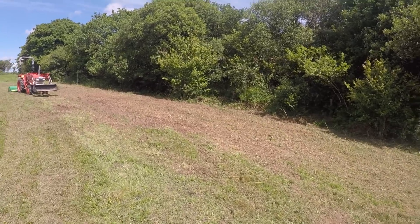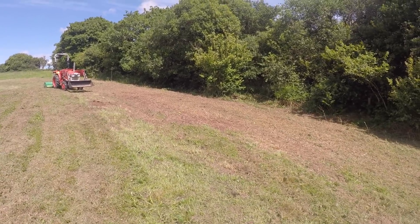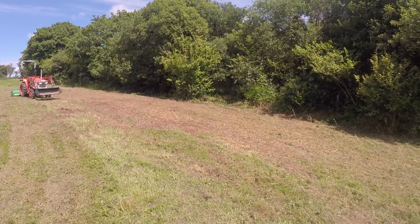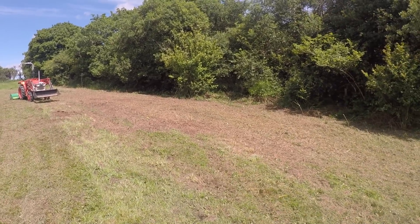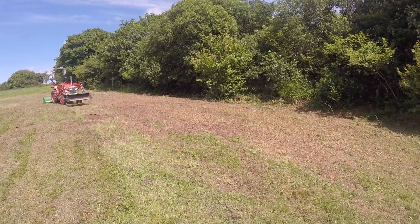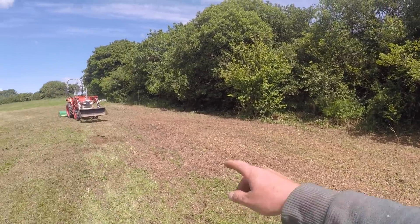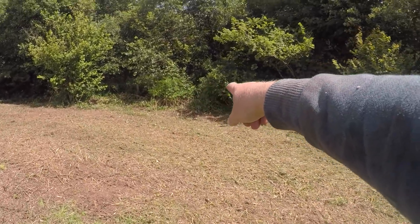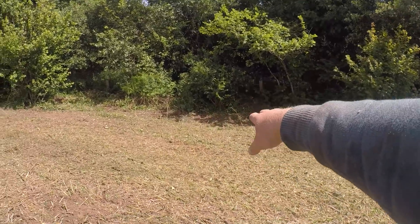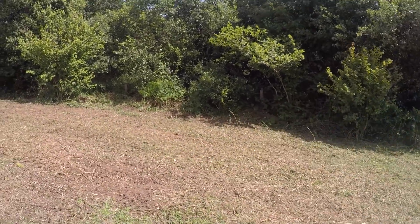That's the area cleared. That was essential because if I'm going to put the building here, there were trees blocking it — and obviously it's a solar shower, so the sun comes from in front of the building behind me, so it was essential I cleared that out. The boundaries are there; that area's not supposed to be woodland. Now I can see where the building goes. I've taken measurements and I know I can gravity feed the water. It looks most level just there, so that's where the toilet's going to go. Next step is to start moving some soil, make a level area, and put some stone down.